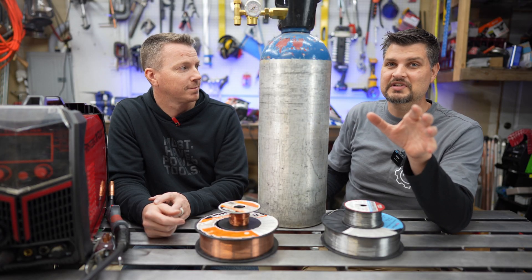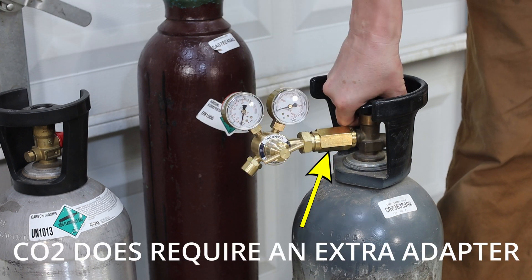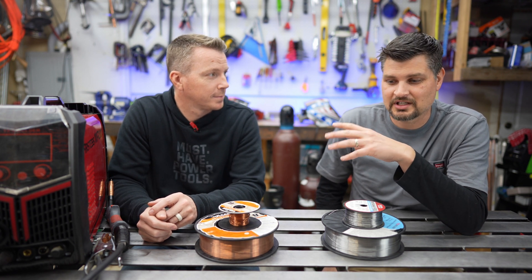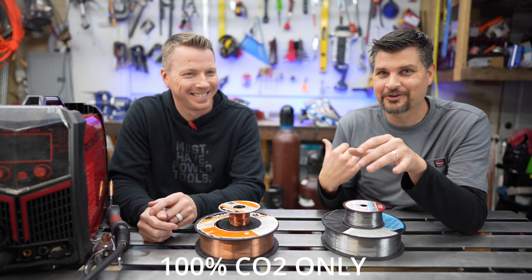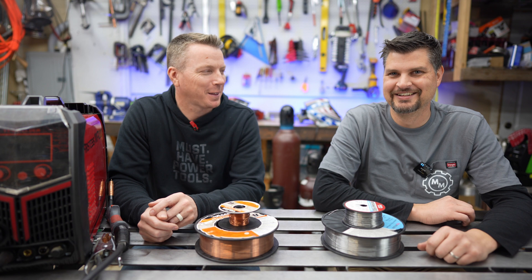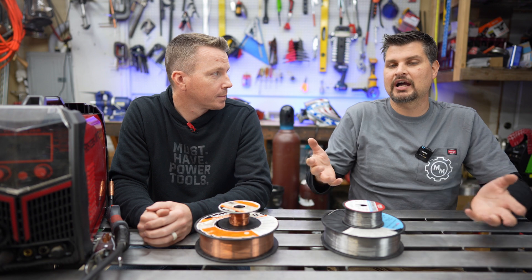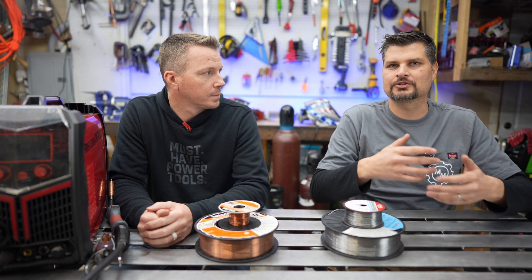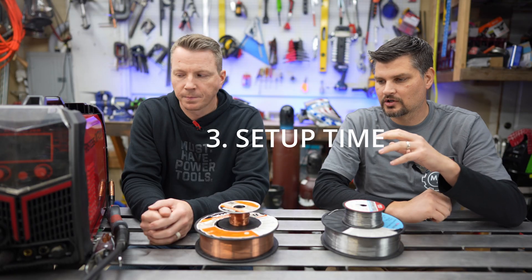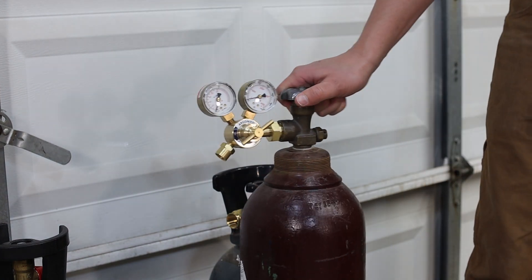Speaking of gas — 100% CO2 is actually cheaper than your mixed gas, and it works just the same, so why not pay less? Side note: they actually do sell little regulators and kits so you can make your own carbonated beverages with CO2. Second disadvantage, other than the initial cost, is portability. You've got many things to haul, so you're not going to easily take all this stuff out to the field. It's kind of a shop-on-a-cart setup. Setup time is also a slight disadvantage for MIG since you're having to run the gas, hook up your flow meter, and get all that set up.